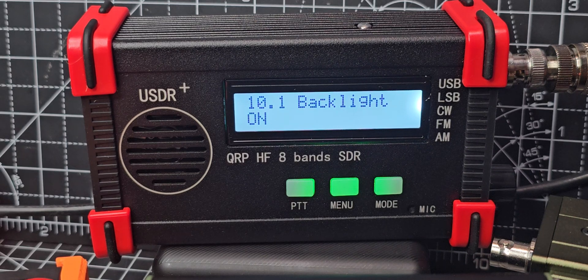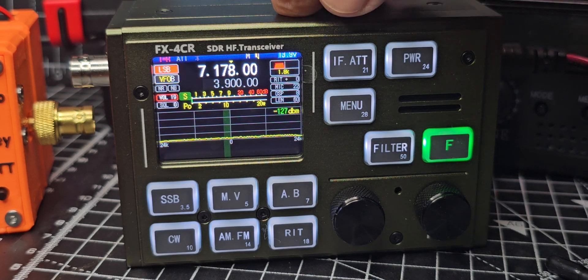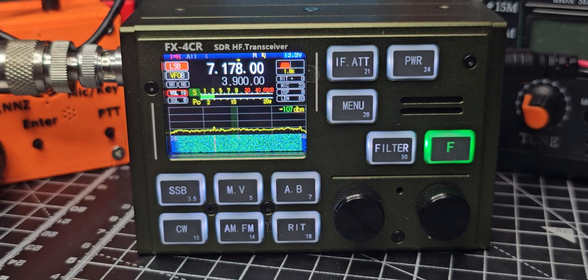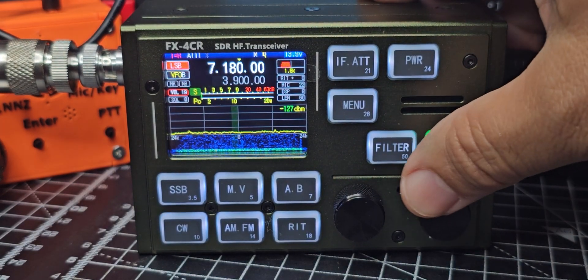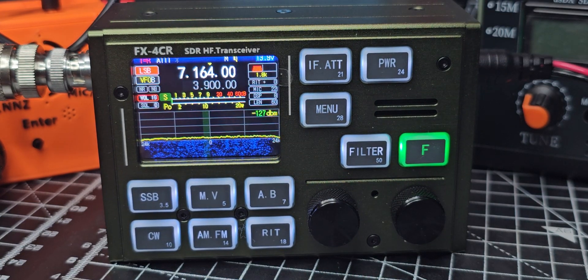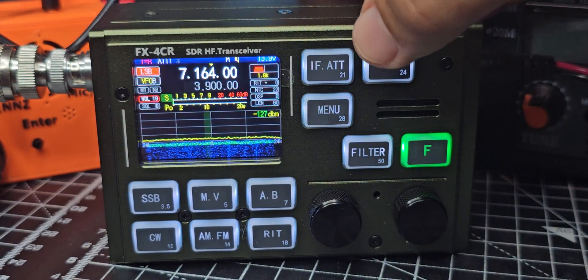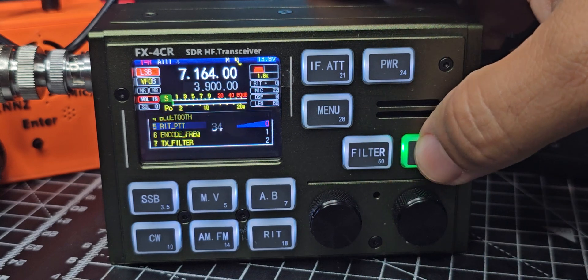Lastly, let's look at the FX4CR, which is a completely different device. It's small and compact, and it's a 20-watt transceiver covering 3.5 all the way up to 54 MHz — but don't quote me on that. I got mine from AliExpress. This newer third-generation model has USB-C, DC input, and a little fan. It's an HF and six-metre pocket radio you can use for POTA, SOTA, all those kind of things. The menu is a sort of touch screen — the buttons look like buttons but they're not. You press and hold to get a long menu, tap to go through, and back out with the F button. About £400.